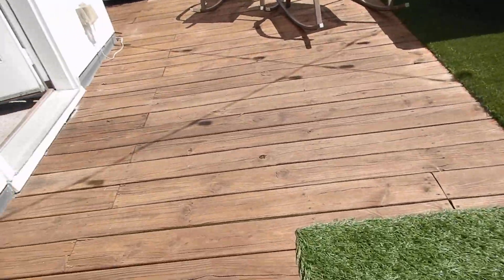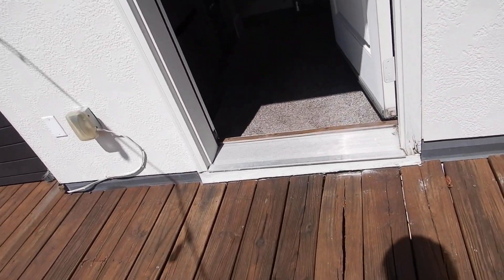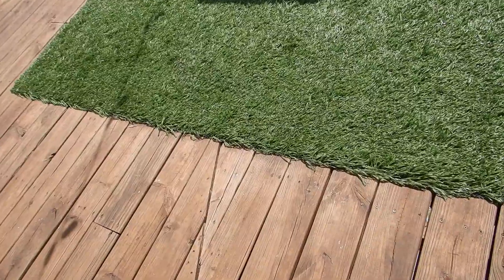This is wood decking. My client was concerned about the wood decking over the roof covering material. This is the same roof covering material that's up there — it's a vinyl sheet. It's very durable, supposed to last 50 years or whatever — more durable than the wood. Right outside the door here, just step on that and the wood's splintering. Not holding up that well. And some of it we can't see because we've got the AstroTurf. The AstroTurf is holding water next to this roof decking and not letting it breathe, which is not going to let it age very well.